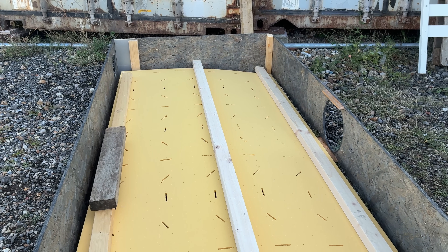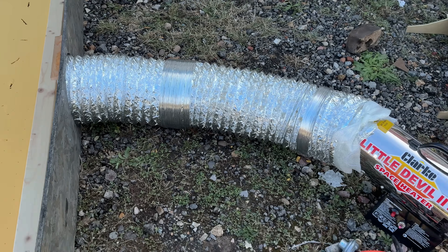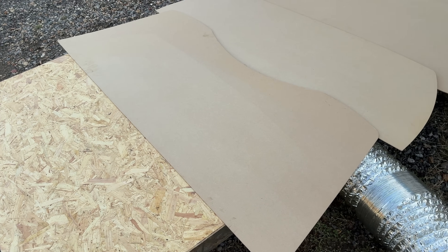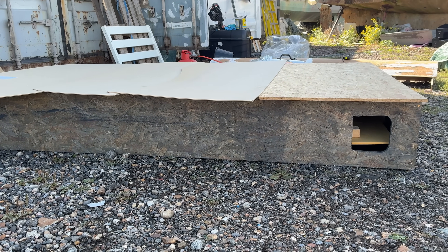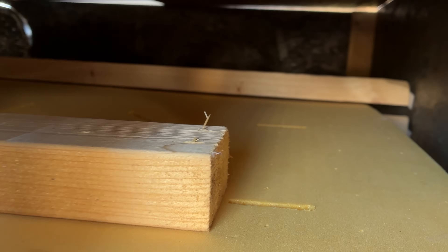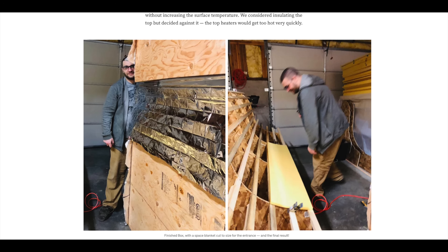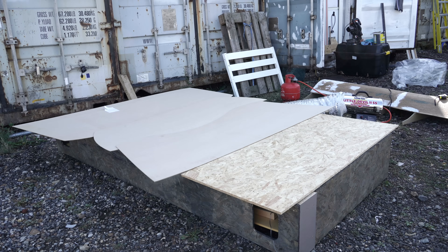Beams under the middle to lift it, and weights along the edges to pull down into a curve. I've decided to extend the duct for now, lest we overdo the hotness and incinerate my precious foam. I've got some heat-resistant insulation boards on order, but just for this experiment these boards will do. Both MDF and OSB is perfectly fine at the temperatures we're dealing with here — they won't suddenly burst into flames. I hope hot or cold pockets don't get trapped in the front corners. It'll heat from the top to bottom, so I'm expecting losses and for it to be slow to heat the foam through.